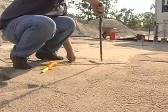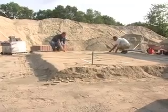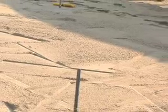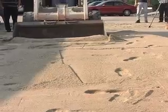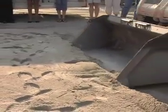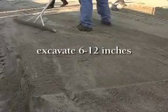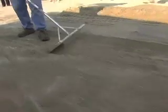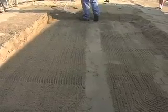Now that we have checked with dig safe and local regulations, we want to mark off the area for our project. Use a level to set your string and use a triangle to keep the design square. Once we know we are not going to dig into any utilities, we are ready for excavation. A standard shovel is ideal for excavation, even though most contractors may use a mini excavator. Excavate to a minimum 6 to 12 inches and remove all the loose soil. Always excavate a minimum of 3 inches wider on each side than you are actually paving. For a driveway, excavate 6 inches wider.